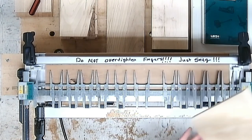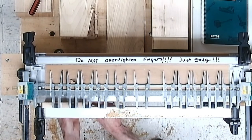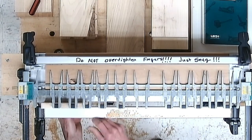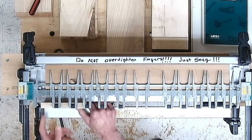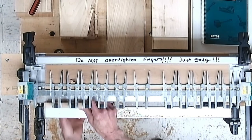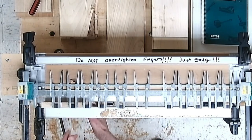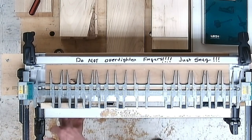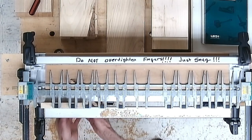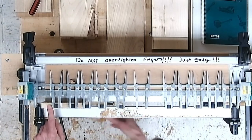And I'm going to take my tailboard again with my line on it, and I'm going to bring it up through the front clamps, and I'm against the side guide. Can you see that side stop over there? Mm-hmm. So that's where the board is referenced laterally. Then vertically, it's coming up and touching the underside of my pins. Or I'm sorry, my fingers. So one thumb pressure clamps that in place.